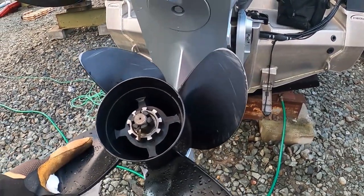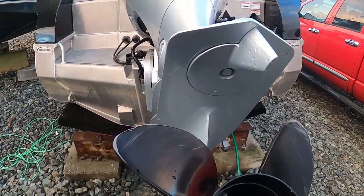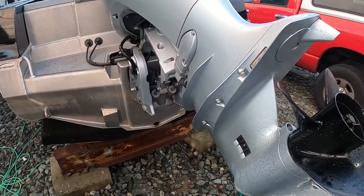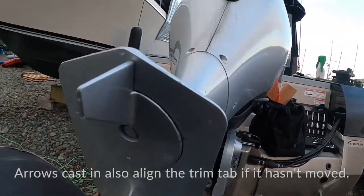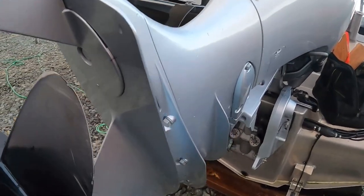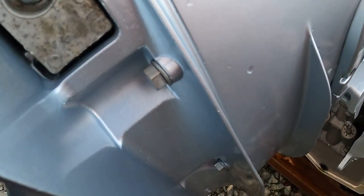I've seen various people say pull the prop, don't pull the prop — actually I haven't seen anybody that says don't pull the prop, but it looks like there's plenty of room here so I'm about to find out. I forgot to grab my tripod but I'll try and film what I can. I brought a sharpie and I've marked a small arrow and outlined this side of the actual tab itself so that should get me back aligned. I think I'll be able to do this without pulling the prop, but I'll probably have to make another return trip because there is no space to get a 14 millimeter socket in here with a ratchet head.